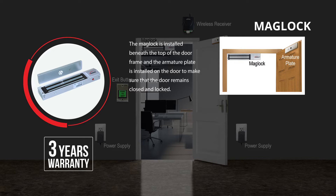An electromagnetic lock only needs to be rated for the strength of the door it holds. The door and frame need to be strong enough to utilize the locking force available from our mag locks — 300, 600, or 1,200 pounds. We recommend 300 to 600 pounds holding force for interior doors, and 1,200 or more for higher security, such as exterior doors or interior computer room doors. The LED light on the mag lock helps you identify when the mag lock is locked and unlocked.